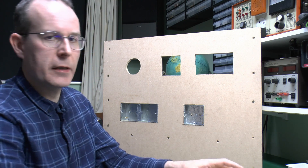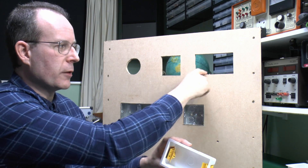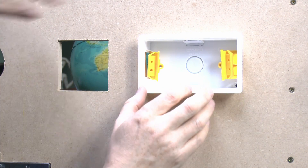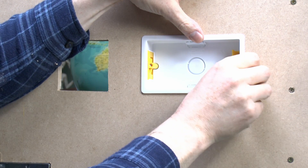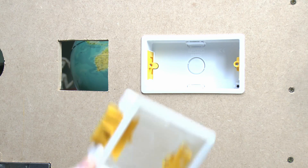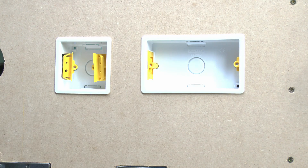So that's really where the plastic boxes come in — you can fit these from the front. In terms of installing these, it's just a question of making the appropriate sized hole and then the box just presses into it. So we've got our suitably sized hole, the box just places into that, press it in, and then the two side tabs — just a question of snapping those into place. It presses through and then it pulls forward and locks into position. Then you can obviously fit your socket or whatever on the front, and cables can come in from the top, bottom, or at the back.